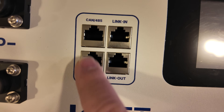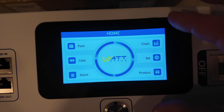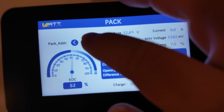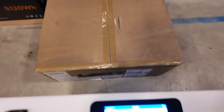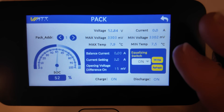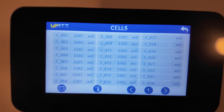Here's the battery — negative terminals on one side, positive on the other. There's good standoff clearance to the terminal screws, which should reduce shorting risk compared to some previous batteries. We've got communication ports and a nice big breaker. Let's flip it on — wow, that is a deluxe screen, one of the best I've ever seen on a battery. We've got state of charge, voltages, temperatures, and we can change the pack addressing. Active balancing — they call it an equalizing switch — can be turned off and on in software, which is the first time I've seen that.